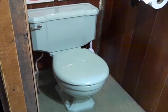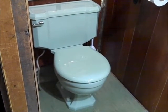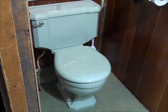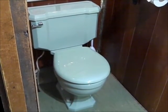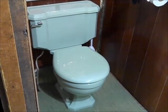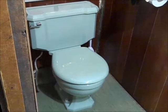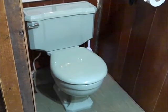Today I'm going to measure the amount of water that the Elger Silenta actually uses. I'm going to turn the water off, flush the toilet to empty the tank, then manually refill it. Then I'll turn the water back on, aim the bowl refill tube into a gallon jug, flush the toilet, and then measure the water that comes back into the jug.